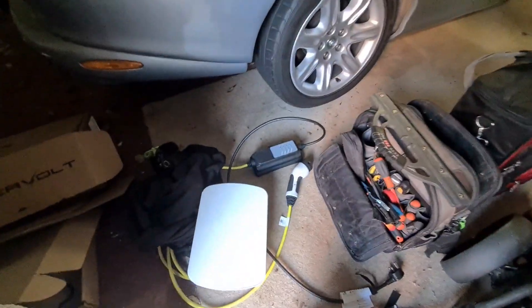We are going to install a dedicated cable for this charge point in the new year most likely. This is a case where a customer has an electric vehicle they need to get on charge - they weren't happy faffing around with the little plug-in lead into a socket, having read up on how that can damage sockets over time. We can use load monitoring to make sure there's no issue with the sub-main circuit out here.